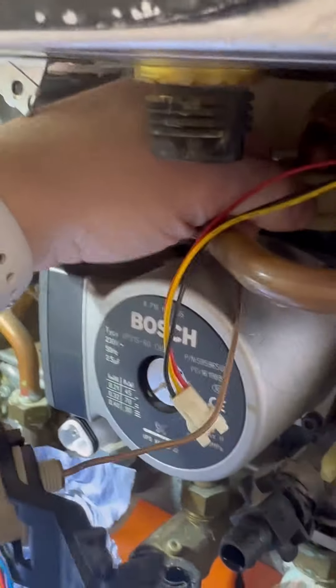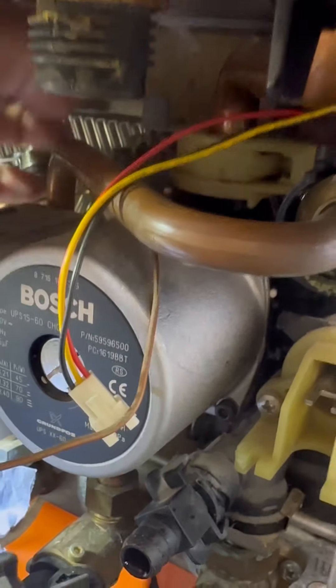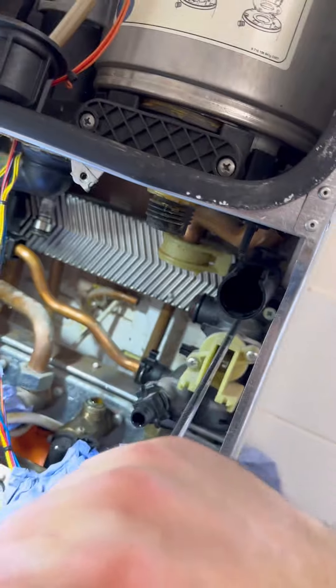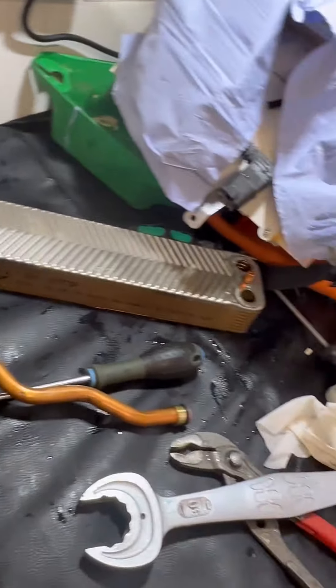So on this occasion I'm going to whip the pump out, change the plate, change the flow adapter, and change the PRV. I've got plenty of videos of me taking all this apart so I'm not going to do it on this one — I'm just going to skip through it because it didn't quite go to plan. Remember to pull the little clip down for the PRV otherwise it can be a nightmare. They'd piped up the bath without going straight to the wall, so I ended up having to take the whole manifold out anyway, left and right.